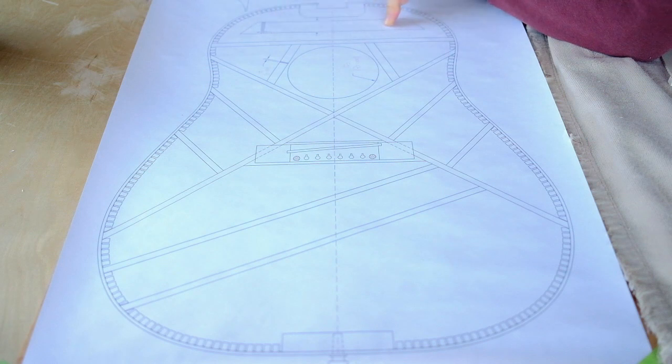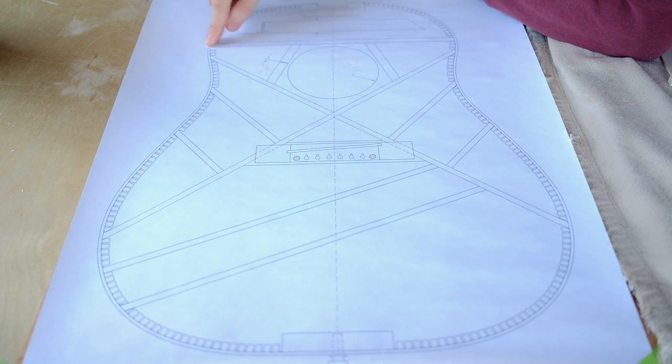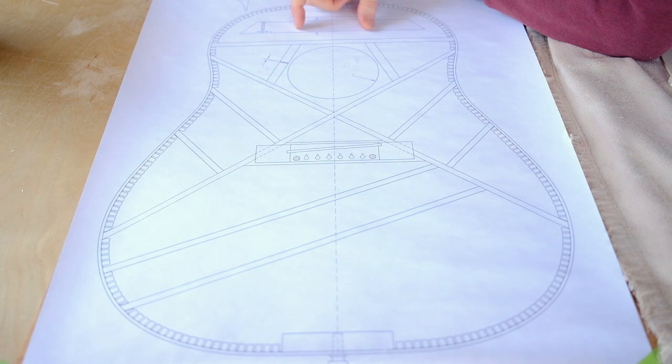This variation allows you to put flatter braces down here as opposed to tall finger braces — there are a bunch of different variations out there. Also, reinforcing around the sound hole in case any cracks start is fairly important. The bracing up here is designed to withstand the downward force of the fingerboard on the top. The strings are pulling the neck up and actually pushing the fingerboard down into the top — you'll see on a number of old guitars that the fingerboard is caving into the top because this area isn't strong enough or the neck block is rotating. This patch is mainly to stop cracks along the side of the fingerboard, because ebony and spruce expand and contract at different rates, and guitars without it often develop a crack next to the fingerboard.